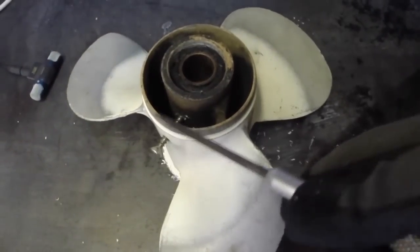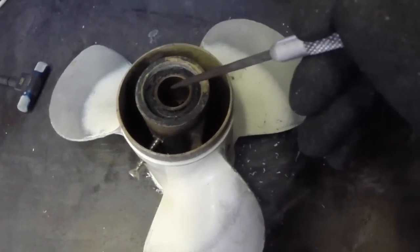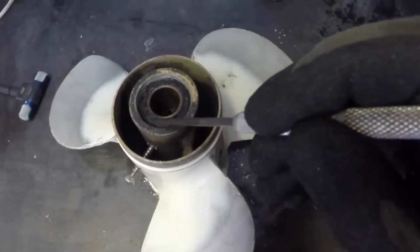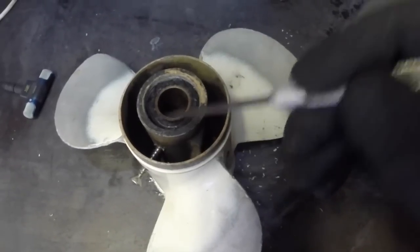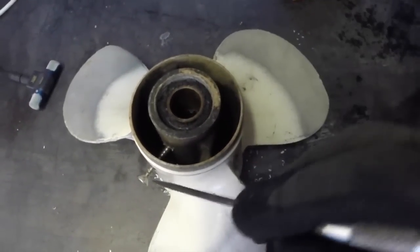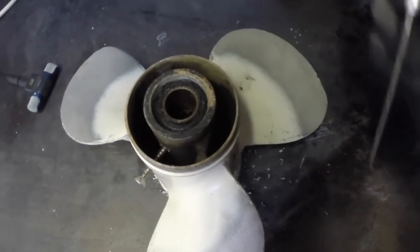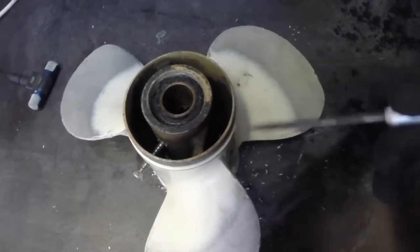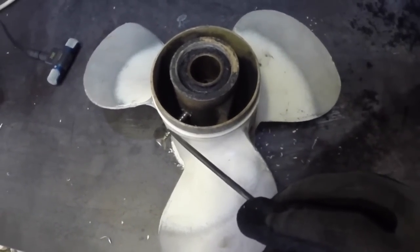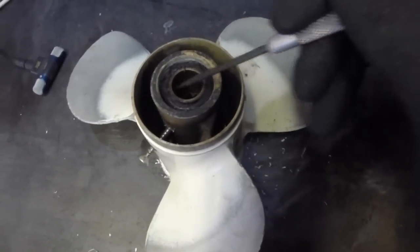So now that first screw's in — it's gone through the outer housing, passes through the section of the prop where the exhaust comes out, through this bushing housing, through the rubber, and it's pressing against the metal of the spline section. Now you can see this screw has pushed the bushing across — it's a bit fatter here and a bit thinner here. So the idea now is you drill this side again, then you'll have three screws. Use those three screws to keep tension on them so they hold firmly, but you've got the bushing centred. Keep tightening them, and once done you can use a hacksaw or angle grinder to cut the heads off these screws so they're flush. But make sure you don't do that until you've got them all in and all tight, and this bushing is aligned properly.